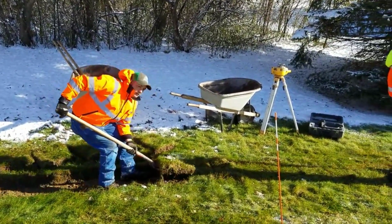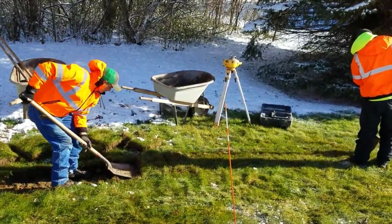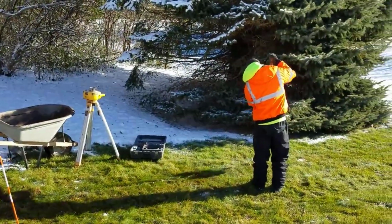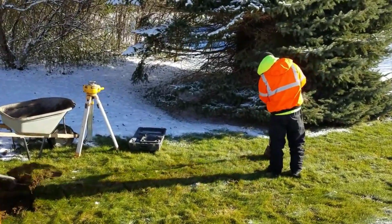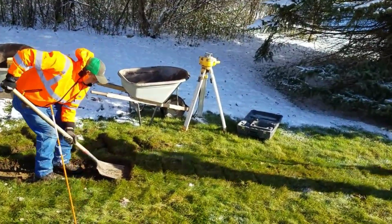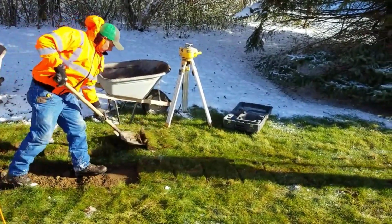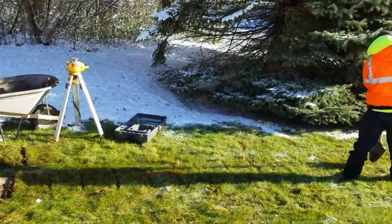When you cut the sod off, you want to take the sod cutter and go as deep as you possibly can. Set it on the deepest setting for the sod cutter. Then you want to go ahead and just cut the pieces 18 inches. That's it. Take a 14-inch real heavy flat shovel and pick them up and put them aside. It'll go back together just like a puzzle.